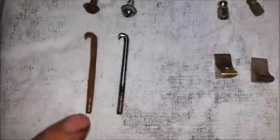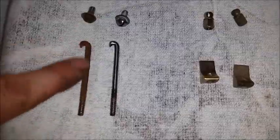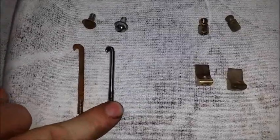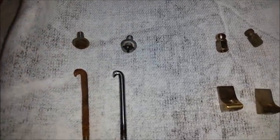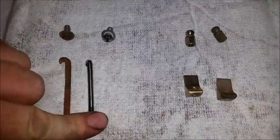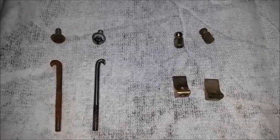Really pleased with the results going from this to this. It's fairly labor-intensive on the brass parts, but coming out of the electrolysis bath removes all the rust. They have a dark tint to the metal afterward, and then just touching them to a polishing wheel shines them back up. Same thing with the screws - going from a nasty rusted screw to this. These literally took me just two or three minutes - out of the electrolysis bath and hit them on a polishing wheel and they almost look like new.